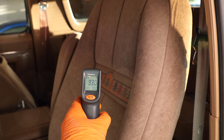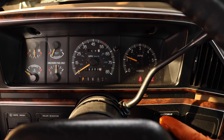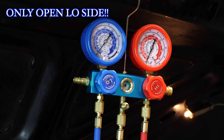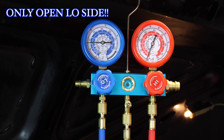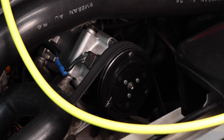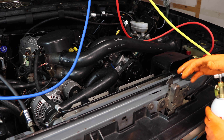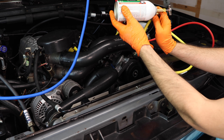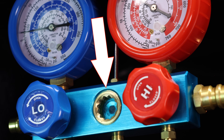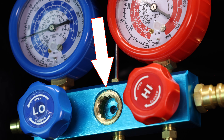I'm checking the ambient temperature inside the truck and it's about 93 degrees. Now start the truck and blast the AC. While your truck is idling, open up only the low side of the manifold — you should see refrigerant starting to flow. Once enough refrigerant reaches the system, the AC compressor should kick on. The compressor will cycle on and off until it has enough refrigerant, which is completely normal. While the refrigerant is being sucked through the line, rotate the can back and forth and give it a couple of good shakes to make sure you get all the refrigerant out. You can monitor the refrigerant flow through the viewing glass. Once the can is depleted, verify that through the glass window and move on to the next can.